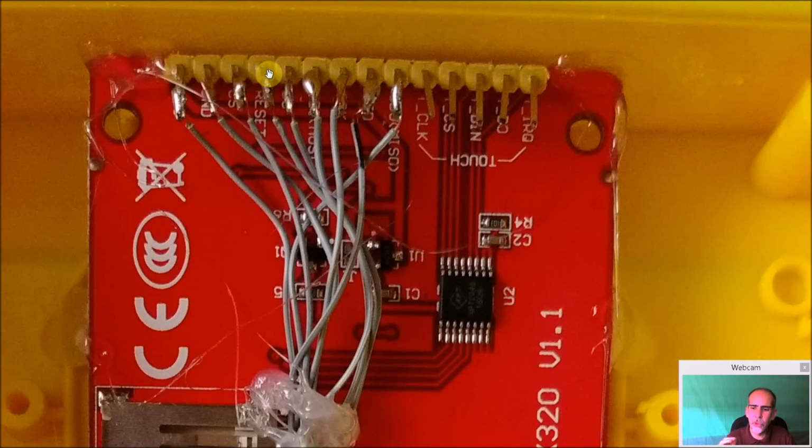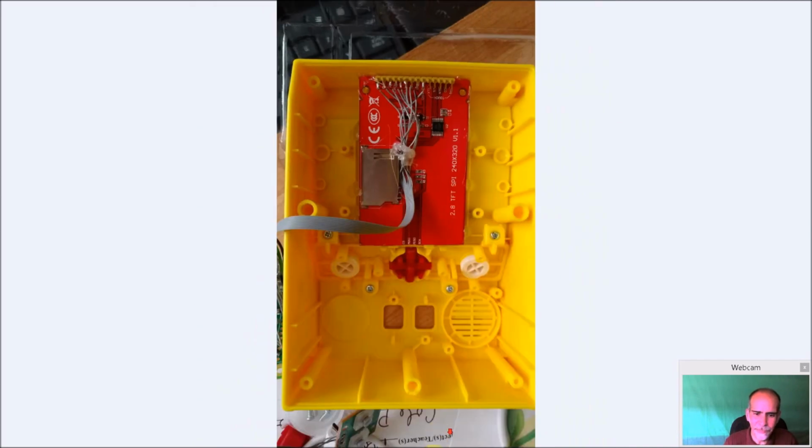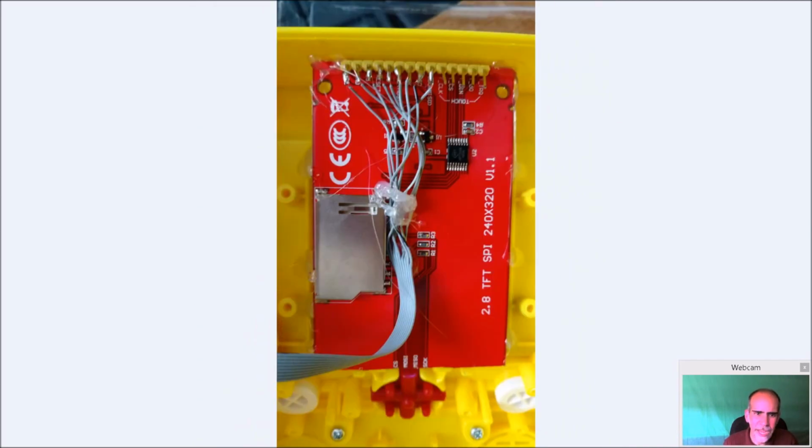And I didn't do it so much where it was loose. I kept it so the screen actually pressed in a little bit, but I didn't want the top bulging. It's just enough where it's pressing without bulging that top layer a little bit, and it fits in real nice, and the display won't move. I mean, once you put some glue on the two sides, it's not going to shift in any way, shape, or form. It's locked in, which is what you want with a handheld to be moving around a lot. And again, just another angle, trying to get a better camera shot of all up in here on the display.